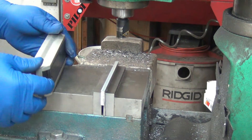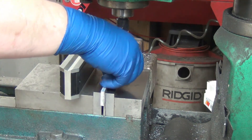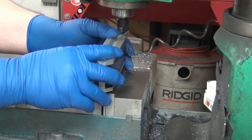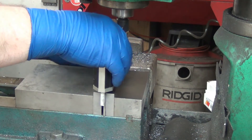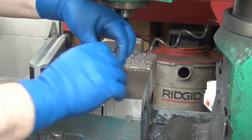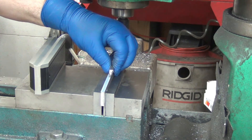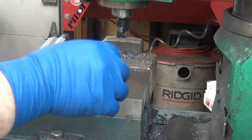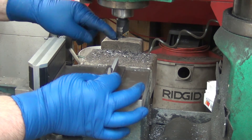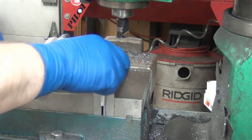I don't have a sine bar or anything like that. I do have a couple other things to do angles with that I could set three degrees, but I'm kind of thinking I'm just going to set this on here — I don't need to pick alt-zero because it's 0.0 right now. So let's tilt it up at an angle, because tilting this side up is going to give me a pocket. That way I can hold it space-wise in here; it'd be easier to put this in from this side and work the clamp with my left hand. With this cutter I should just be able to run back and forth on the Y. Let's check it.